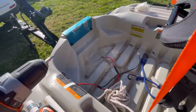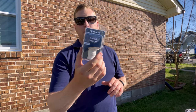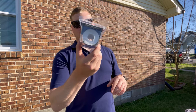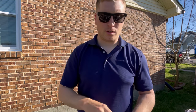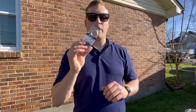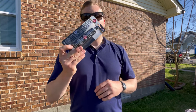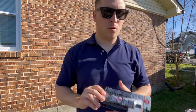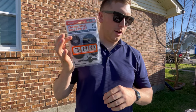So I've got some tools here and I'm gonna make a scupper hole that's gonna let water drain out of my boat anytime it gets in. Some of the things you're gonna need to put a scupper hole in the Bass Raider: the Atwood through-hole connector — that's what's gonna be your scupper. You'll need a wrench to tighten that down, some plumber's tape to get a good seal on the threads, a plug so water isn't coming up into the boat while driving, and some gasket sealer to get a good seal around your scupper hole.